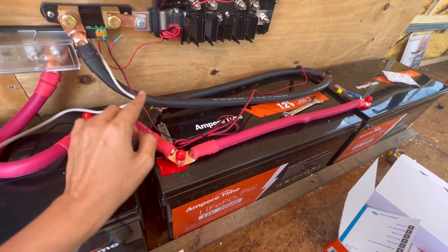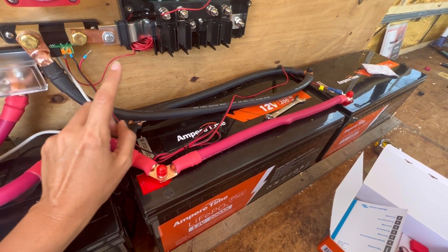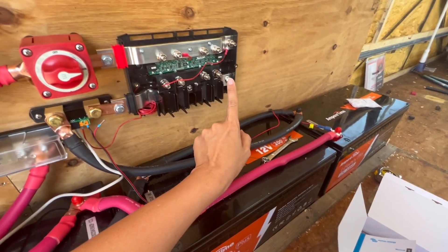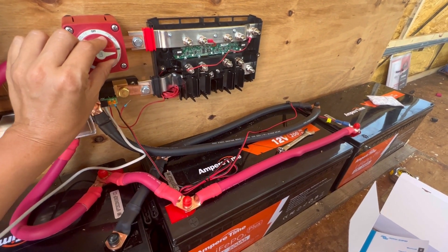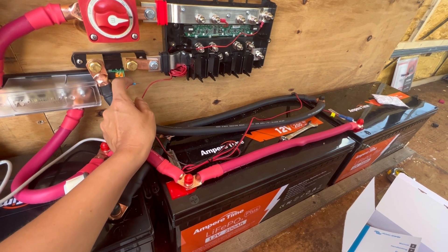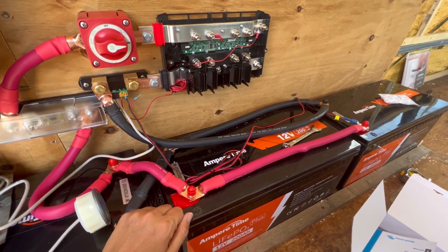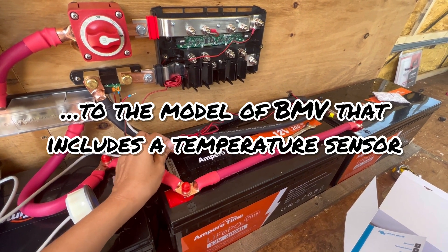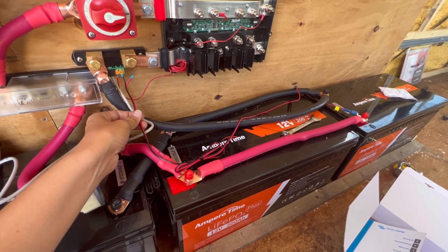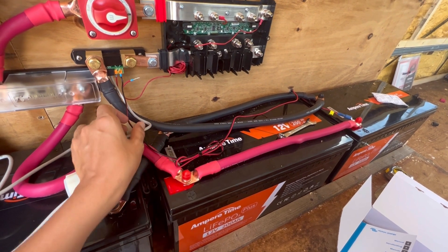So what I've done is run the temperature sensor wire, which is the black one, to the spot where I want the temperature monitored. And then I've used the other cord that provides enough current, connected it to power. And instead of connecting that also to the battery terminal, I've connected it up here. This way, if I turn off my entire power system, it will also turn off the monitor so it won't be drawing power. I'm going to put some electrical tape on the end of the unused connector so it doesn't fly around and cause a problem. Just wanted to let you guys know that if you do upgrade to the temperature sensor, the power cord is not powerful enough to actually turn on the monitor. So you will have to use both this cord that comes with the kit and the black side of this cord for the temperature sensing capability.